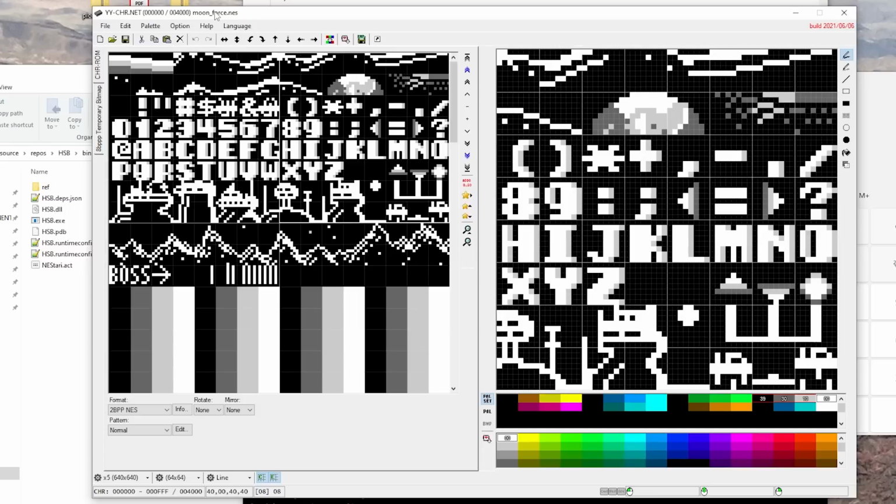But the nice thing is, people who do this workshop, they can just use their computer and they can install Arduino, install the drivers for the Pico W, and they're good to go. They don't need like a separate programmer or anything. And as an added bonus, since we're just soldering a Pico W right onto my little circuit board that I'm going to make, I don't have to buy a USB port. Like the last time we did this, USB port was like the second most expensive item besides the screen.